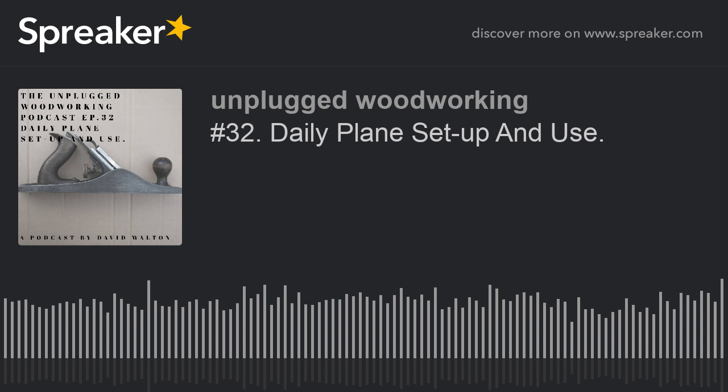So what I do, I'll use my first finger and my thumb as a bit of a guide, and I'll just start planing like that. Depending on the situation, i.e. have I just ripped the piece of wood? If I've just ripped it, there might be high spots and low spots. So I will take a couple of passes, and the plane will identify them, because obviously you'll hit the high spots and you'll skip the low spots.